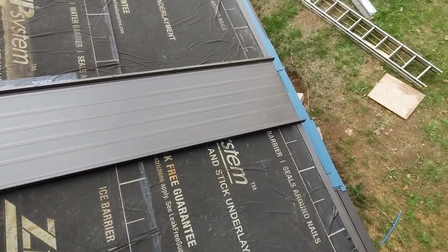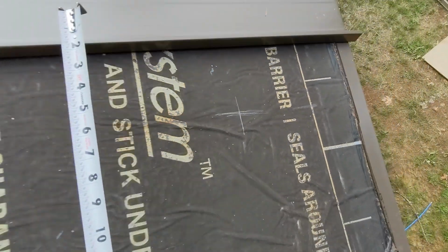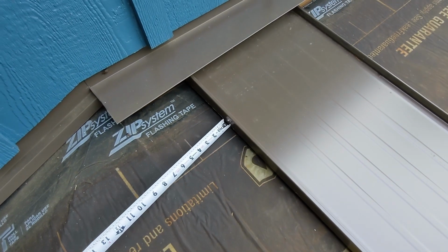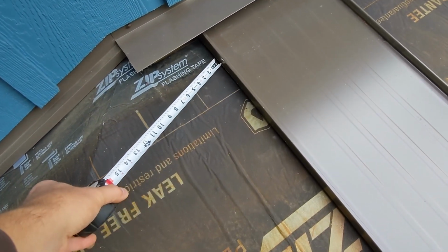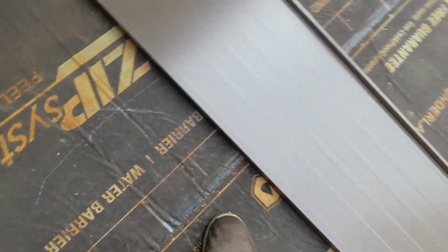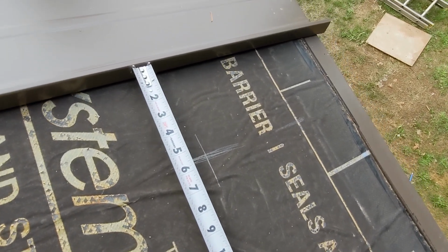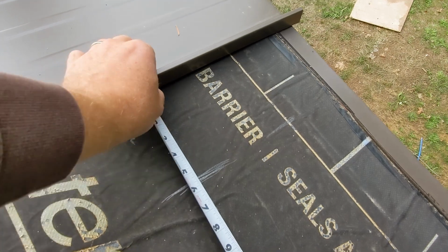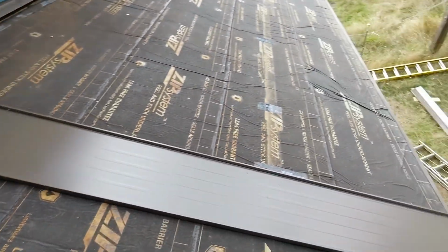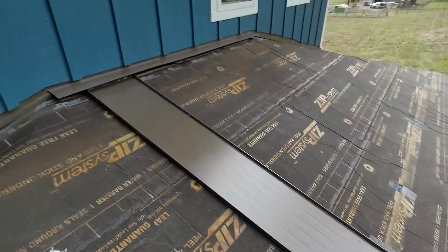Okay, this is super simple. So on the bottom, we just pulled this over and put it to 5.5, and then up here I have a line that corresponds to the on centers that I want. I'm just going to adjust to where it just barely shows, so I can see it. And then right here, we're at 5 3/8. So down here, I just correct for that 1/8, making sure that we're at 5 3/8, and pull that just a hair over. And now we have this perpendicular, and as we put sheets that way and bring sheets this way, they should stay aligned to the building.